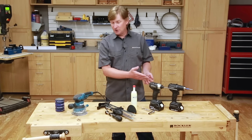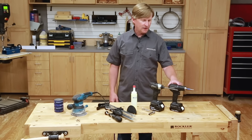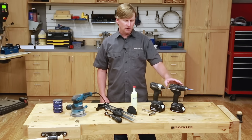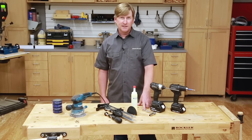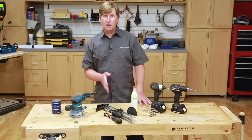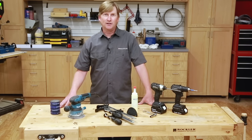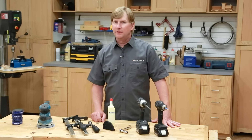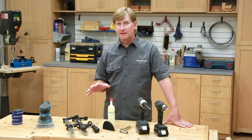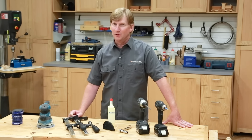Today I'm going to show you just how easy it is to build one of those tables — it's actually so easy that I can show you all the tools I'm going to use before we start. I've got a drill driver, an impact driver (you could actually just use the drill driver), a ratchet with a 7/16 inch socket, glue, a glue spreader, a couple clamps, a random orbit sander, and a stack of bench cookies for when we're finishing the top. This is a big project in terms of size but any DIYer can tackle it.